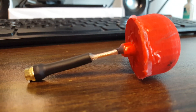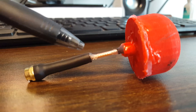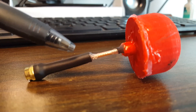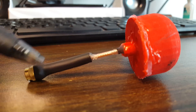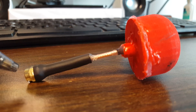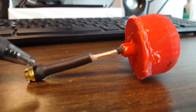What I like to do is take some heat shrink, cut a piece that goes about halfway up the length of the coax, and slide it on. Then I get my glue gun good and hot and just glob as much glue as I can in there. The glue is going to start shrinking the heat shrink, so I glob as much as I can until the heat shrink sort of starts squeezing it out at the ends, and then I take my heat gun and continue shrinking the heat shrink.